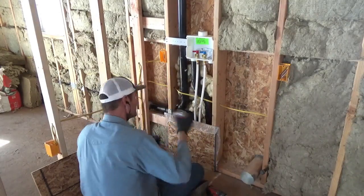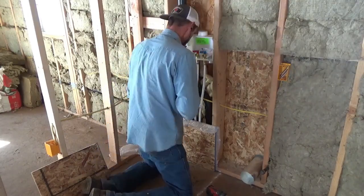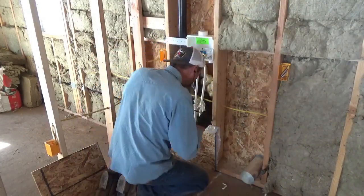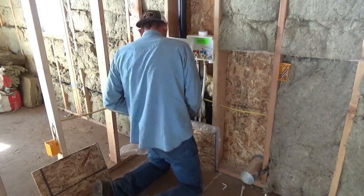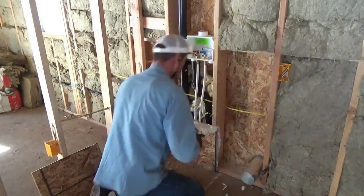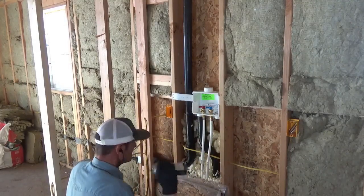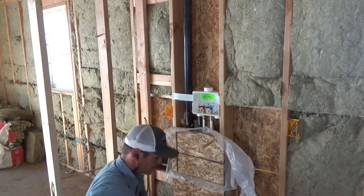This is the washer box upstairs in the laundry room. I initially moved the P-trap out of the wall and planned on putting Thermoflex insulation around the half-inch pipe, but again I decided that using the spray foam I could get this safe enough where I'd never have to worry about any pipes breaking. I've got to worry about the two-inch P-trap as well as the half-inch PEX lines.